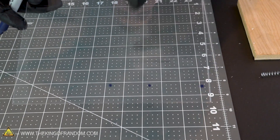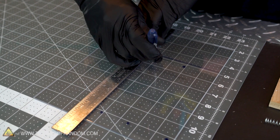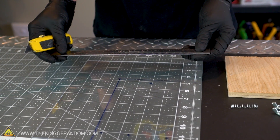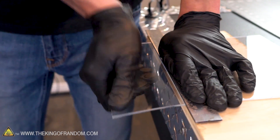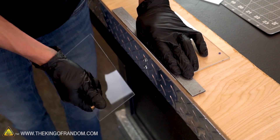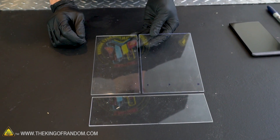You should now have four spots marked out in your plastic where you're going to drill holes. But before you do any drilling, you need to cut out a rectangle that completely contains those points. There are several ways to cut acrylic. I find the easiest for a sheet this thickness is to score the plastic with a sharp knife and then bend it over a hard corner. Don't throw away those pieces that you broke off because we are going to use them later.